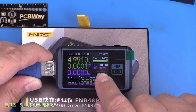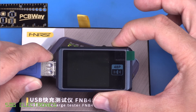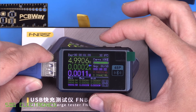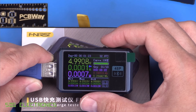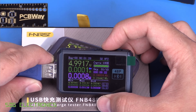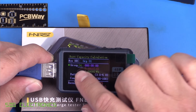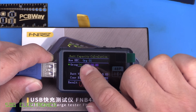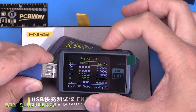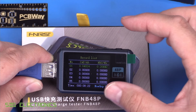There's a power and energy screen showing minimum, maximum, and average values, as well as accumulated readings. Counters can be cleared by holding the back button, holding the scroll wheel, and clicking clear. Holding the scroll wheel to the side accesses battery capacity testing with 10 data storage slots. Holding it to the left shows all storage spots where you can review captured data.